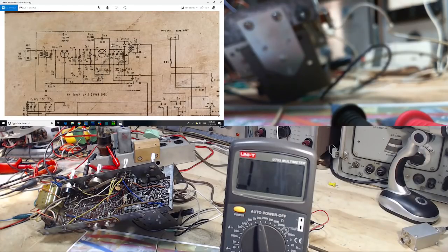Yeah, I'm really tempted to pull this transistor out. No, we don't do that. There's a zero here. No short through this transistor, but there's 0 volts sitting here. 2.4 is, there should be something here. Well, maybe if this was open. I think if this is shorted, but I keep reading a resistance here. What am I not doing right? Do I have the collector and emitter mixed up? Did I get my chart not worked out properly?